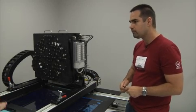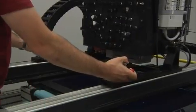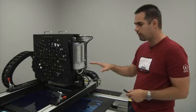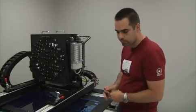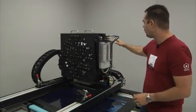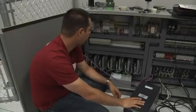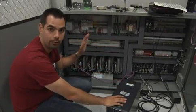Awesome. Now, you said this moves in an XY axis. We'll see it moving hopefully in a few minutes. Yep. But tell us how that works and how the robot knows where it is and moves around. Sure. So there's a National Instruments controller card that we'll go take a look at, and it's going to turn motors on the back here, which turn these belts, which drag this both ways, and then also are plugged into here. So what we'll do next is we'll take a look at the box that has all the motor controller components in it. Cool. Okay, so this is the control panel for the National Instruments cards, basically, that control the 4 motors.